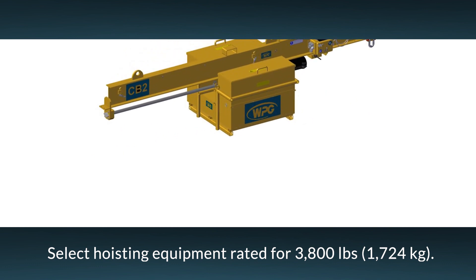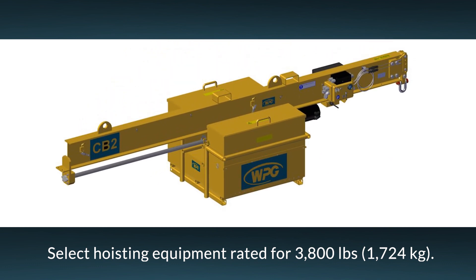This amount includes the weight of the load — shown in instructions as the maximum load capacity — the weight of the counterbalancer, the user's supplied counterweight material, and the vacuum lifter. Make sure all your hoisting equipment, including crane, hoist, slings, and other rigging, complies with all laws or regulatory standards for your region.